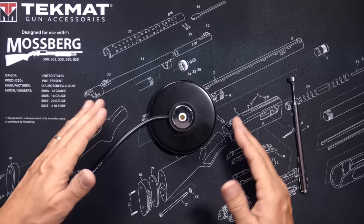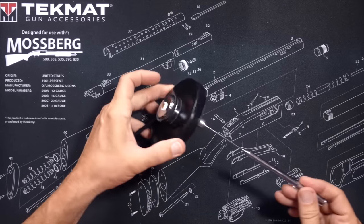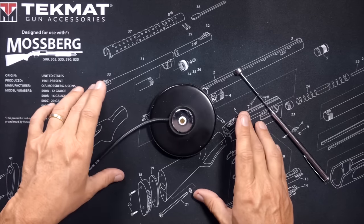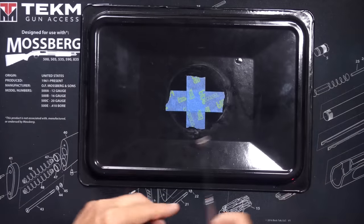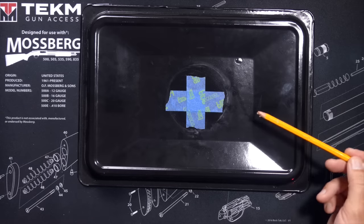Usually, the ground plane is simply the metal of your car that your antenna is mounted on. Contrary to what many online experts say, the ground plane does not have to be physically connected to your antenna. For example, if using a magnetic mount antenna, the RF will easily couple right through the rubber coating and paint on the car. Or if you're using a mobile antenna in the house, a simple cookie sheet will also make a suitable ground plane, as long as about three and a half inches or more of metal is extending outward around the antenna.